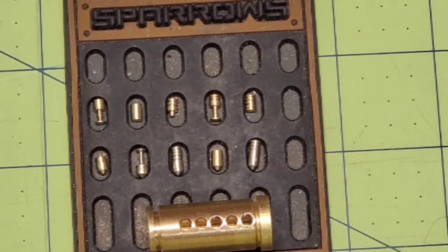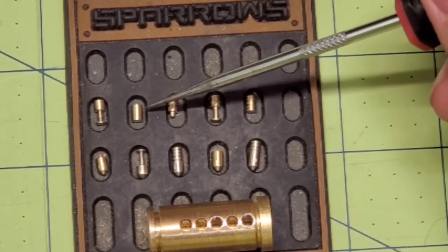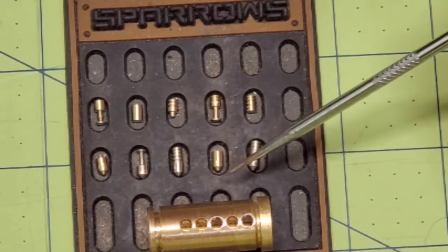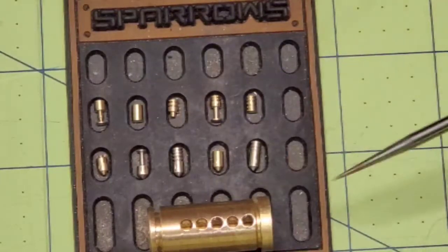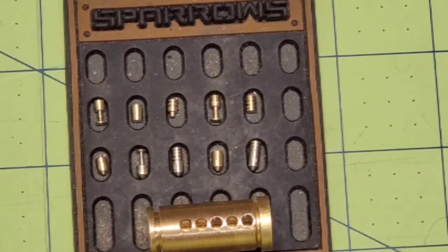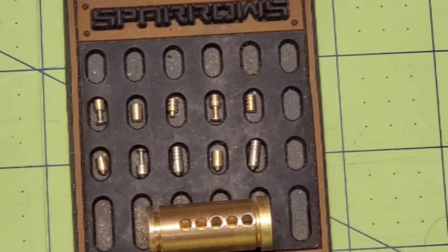I will point out there's a reason, because I've been asked this before, that I leave a standard on the top and a standard on the bottom. If you have a standard pin and a standard pin that are always going to be sitting in the shear line, when you start, you are not going to have that flop when your lock is sitting at rest. So no key in it, and somebody's starting into it, you're not going to have that major flop one way or the other. And there's nothing wrong with that.